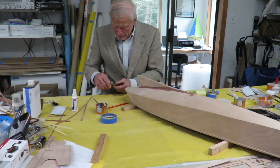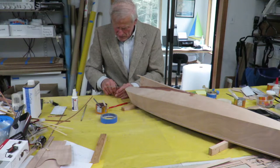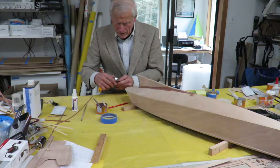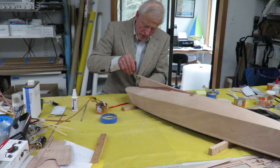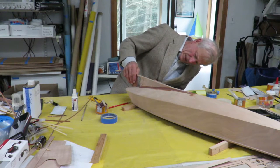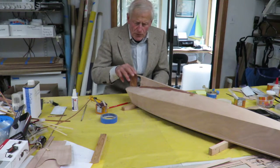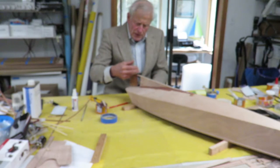We're cutting not toward our fingers here because we don't like blood. Ideally the rudder should slide all the way right up to the rudder tube. If you have any lip of epoxy around the shaft, even the slightest bit, it'd be nice to take that off. Now we can fit our rudder. As I suspected, there's just a little bit of rudder sticking out a little bit deeper than the shoe on the keel, and if a weed is sliding along here it's going to possibly catch on the end of the rudder.